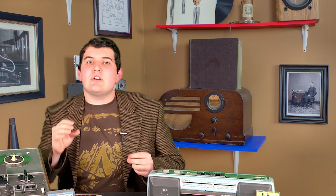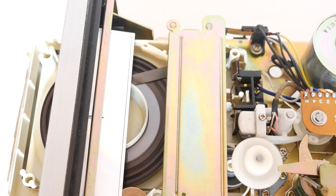Now this had a couple of disadvantages. Because the head physically moved to access different programs on the tape, the head could rather easily get out of alignment. But the bigger disadvantage was one of fidelity — the narrower the tracks are on the tape, the more noise there is, because there's less potential for signal on a smaller space and the noise becomes a bigger part of that signal. So the quarter-track tape we looked at before had tracks twice as wide as the 8-track, meaning the 8-track sound was by default a little worse than standard tape. The biggest disadvantage was due to the infinite loop: you could not run the tape backwards, so if you had just passed your favorite song, you'd have to wait for the program to go all the way through. Some 8-track players allow the user to fast forward, generally only at twice normal speed, but it still allowed you to get back to a song a little faster.